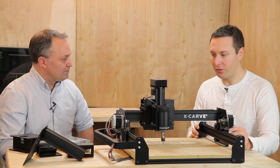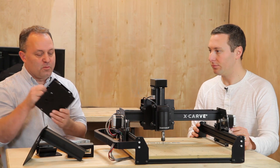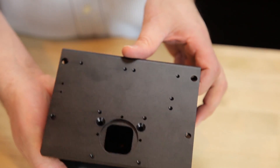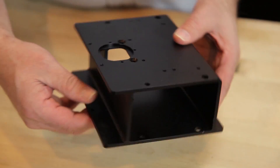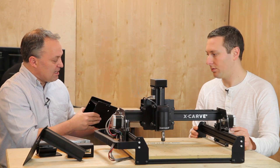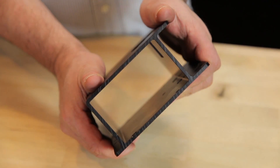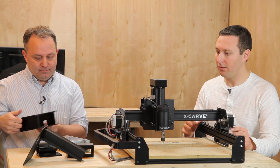Walk us through an overview of the highlights of the improvements that were made. One of the first improvements is changing the X-Carriage to an extrusion — this is a solid 4-millimeter wall thickness extrusion. In the past, you had plates and multiple spacers and screws to hold those things together, which was a little difficult to assemble. Now, this one part probably eliminated about 20 parts, and it's much, much stiffer. So stiffness is one example of what we did.